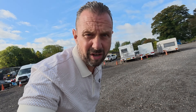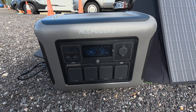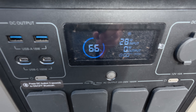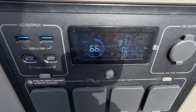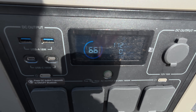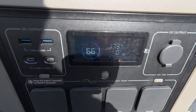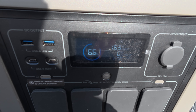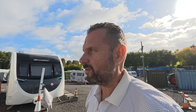That's plugged in — and in theory, if there's any sun at all it should start giving us charge. And it is! You can see it: 28, 29, 30, 31, 36 watts... the sun's coming out a little more — 76, 102, 148, 166, 173... and we got it up to about 176 watts. On a slightly cloudy day with the 200-watt solar panel, that's a solid result.